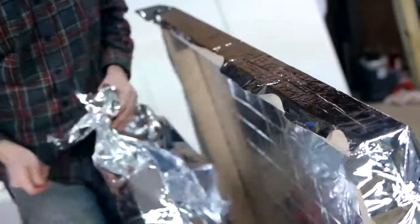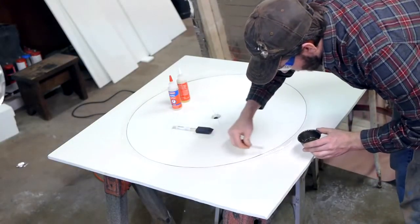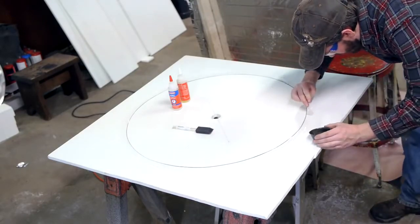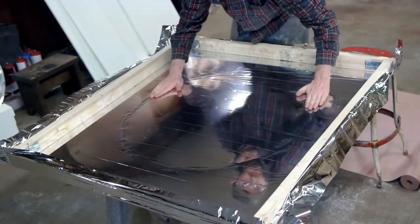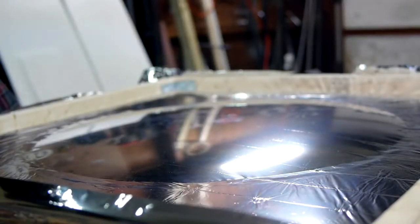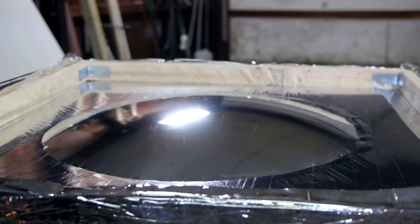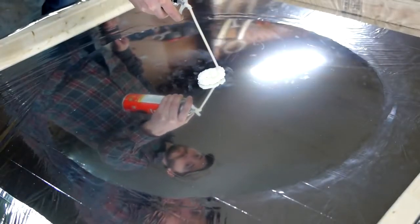The baseboard is prepared, and now so is the mylar, so it's time to see if my method will work. From some tests I did earlier, I found that epoxy is the best adhesive for adhering mylar to PVC, so I'll carefully spread a layer around the outline of the circle. The mylar is then lowered on top and pressed into the adhesive to get a good seal. To provide air pressure, all it takes is a bicycle pump. Though I tried a small one first, I later switched to a larger one I could use without being under the table. As soon as the epoxy has been given sufficient time to cure, I can begin inflating the mirror.